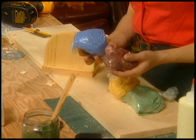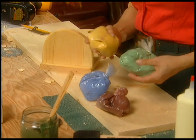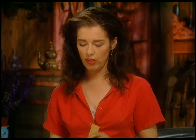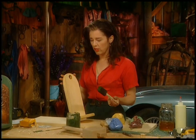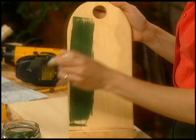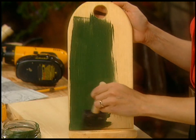I'm going to use actual milk paint. Last year I tried making my own milk paint and it was kind of a disaster, so I've been buying it this year. It comes in all these nice pretty pioneer-looking colors, and I'm going with a Lexington green kind of color. Why not? Live a little. You just mix it with water. Only mix a little bit at a time though, because it really doesn't keep. Now that I've put that sealant on to seal the pine, the milk paint goes on really easily. So I'll just get this ready, and then while it's drying, I'll show you how to do the copper stuff.